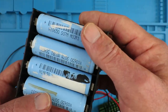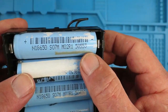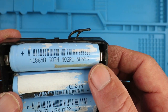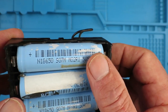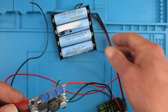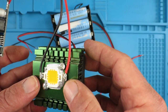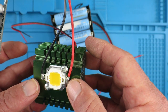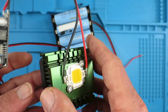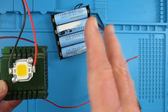The final part of the story — we have four cells here, these are 18650 style cells. I've done a bit of research on the numbers and they appear to be made by a company called DLG, and are nominally 2200 milliampere hours. These are obviously recycled cells, so let's say if we get 2000 milliampere hours out of them. My plan is to run the LED conservatively at 10 volts at 500 milliamps — that's only 5 watts, half its rated wattage — which should prolong its life and the battery life. At 2000mAh with 500mA draw, we should get four hours out of it.